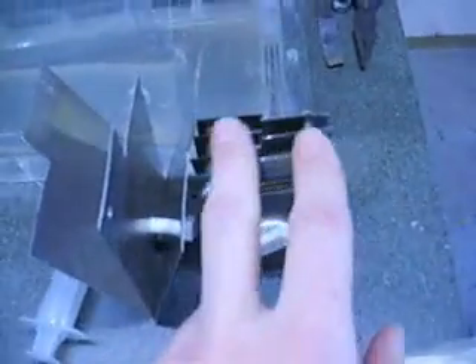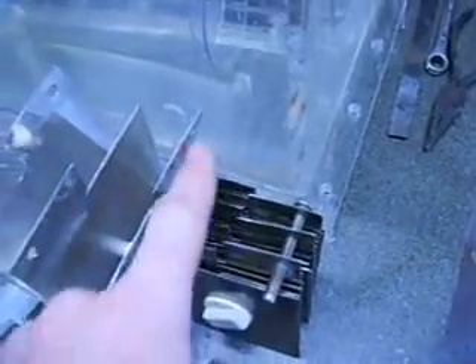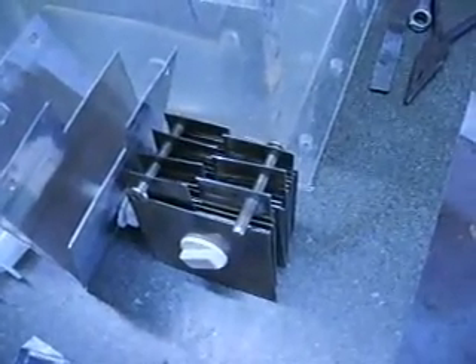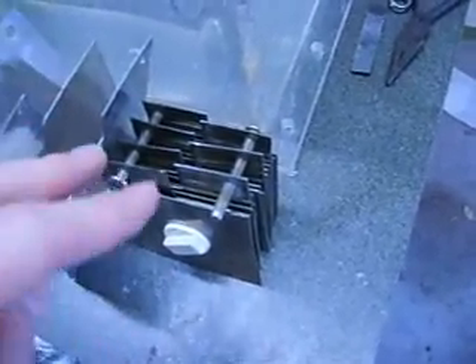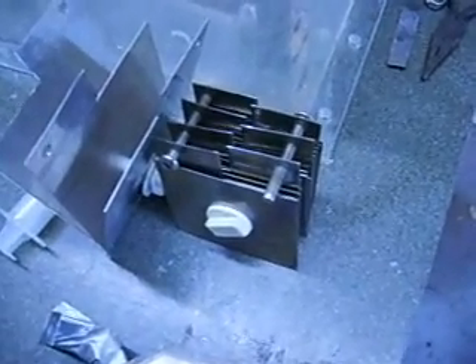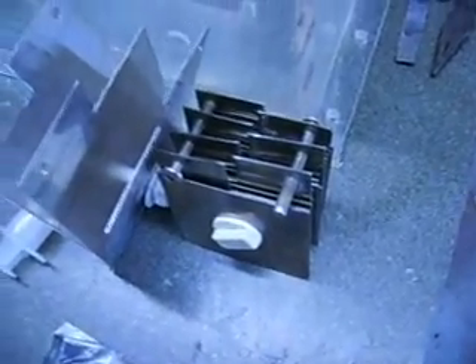As for the way you wire up your cell — on this cube cell here, there is a difference when you have the positive or negative on one or the other terminals. The reason for that is because of the imperfections in the cell itself; it's not perfectly flat, not perfectly straight. You do tend to get a bit of difference between the two. If you were to have a cell that was perfect — both the gaps, plate size, everything — you really wouldn't see any difference depending on which way you wired it up.